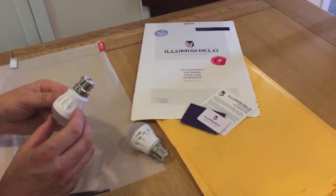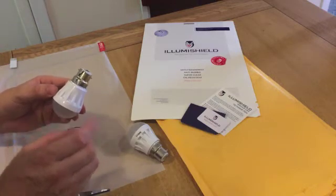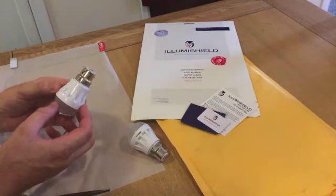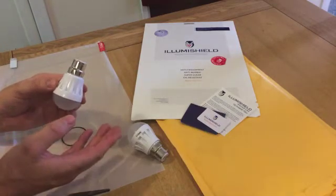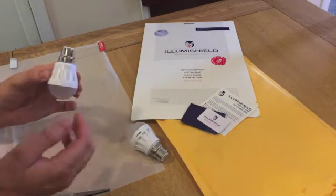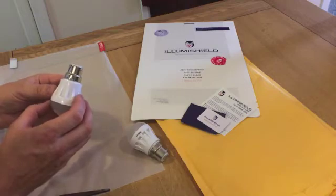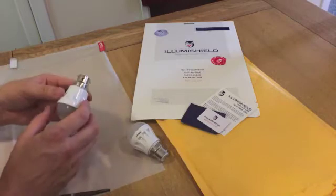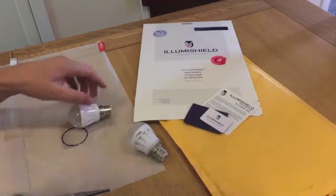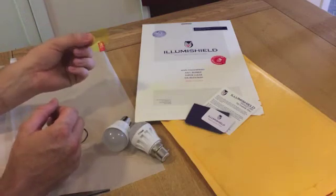So that's this type of bulb. I'll go on and show you different types of light fitting. We've got some halogen-style spots — they're a very different type of fitting because the filter has to be fitted onto the exterior of the bulb itself, as you can't get into them. We've also got recessed spots where you can cut the filter slightly larger than the bulb and fit it under the ring, so you don't have to stick anything on. It's just about seeing what you need to do on each given light bulb and then cutting one to fit.